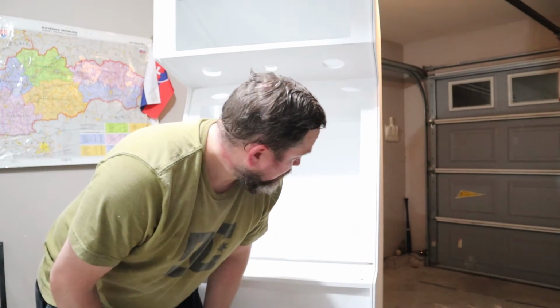That's nuts, man. That's a lot of sanding. Did I mention I hate sanding? Yeah. So tomorrow I will vacuum and give it another wipe with a tack cloth, and then there should be at least a 24 hour wait in between. And then we can maybe start putting some black satin top coat on it.